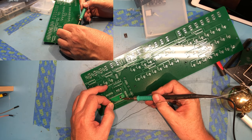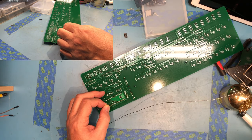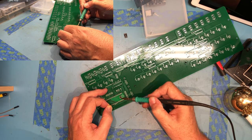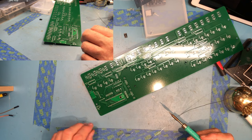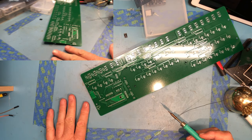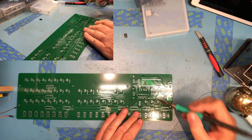I will attempt the same thing with the other three pins. Sorry for the glare from the LED lighting - I need a lot of light to work. Oh, that's a big old ball of solder. If you get too much solder and get a bridge, you can of course use some braid to remove it. One of the reasons we put solder on the first pad and then slid the device into it was - if we had solder on all the other pads and tried to put it in place, it wouldn't sit flush to the board. And we want it down flush to the board. There's a fair amount of solder on this pin, more than it really needs. That looks better.